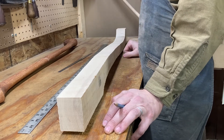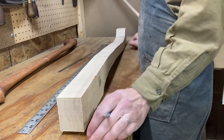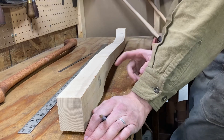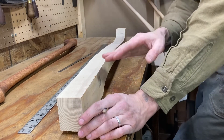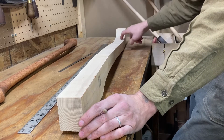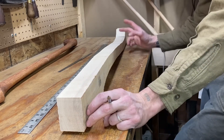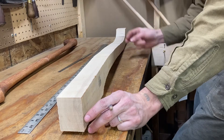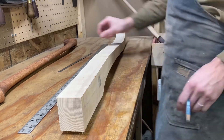As I count the grains up on this handle, it's actually dead straight for such a long run of the length of the handle. You don't even actually have to count the grains — all you need to do is mark center on one end and center on the other end, and stay within the confines of how long it stays straight. It bends just a little bit and starts to pull off down here toward the knob, so I know from basically about here to here everything's pretty straight. I'm going to mark half of the width here and half of the width there.